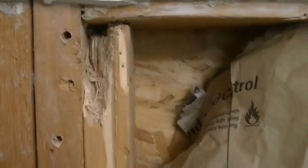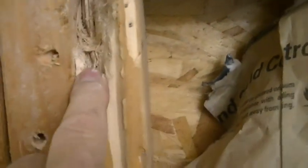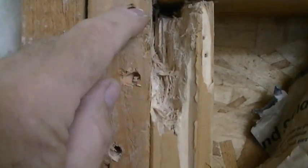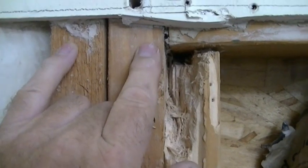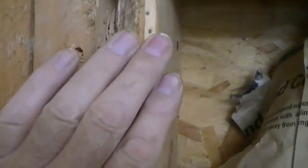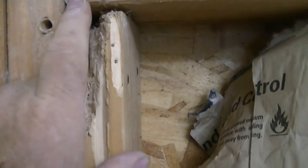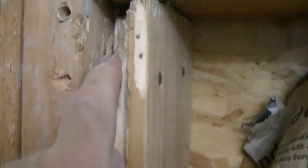The damage is not very extensive at all. I used the multi-tool to cut the nesting area out to see how far it went back, and now we'll take the scope to determine if we need to replace some wood. These two studs are solid — just a couple of holes drilled in, nice and solid. They double-plated with two by sixes up to the top header of the window, so these need to be structurally strong. This filler piece is to hold the edge of the window frame, so not as critical.